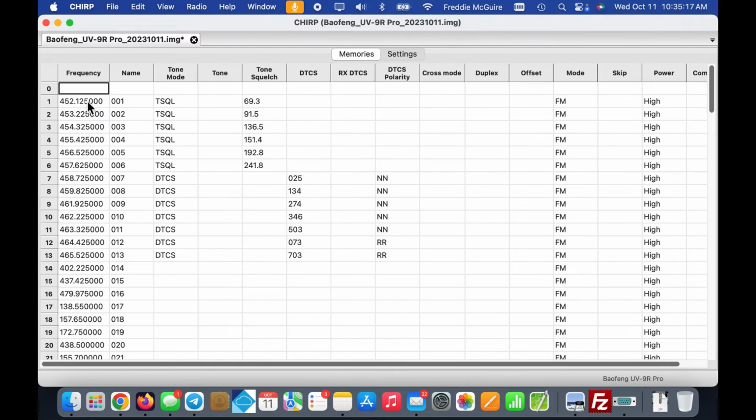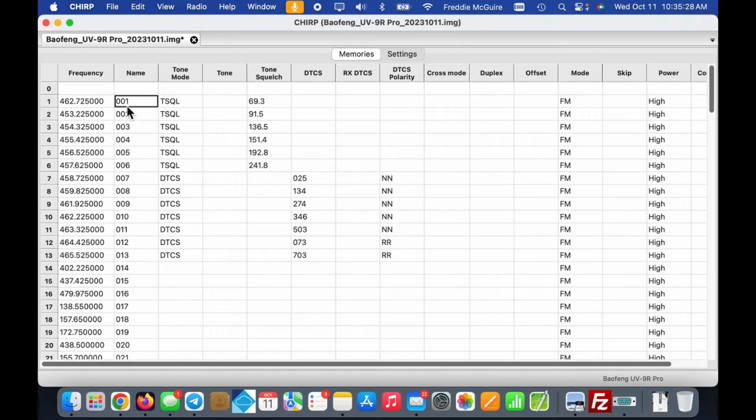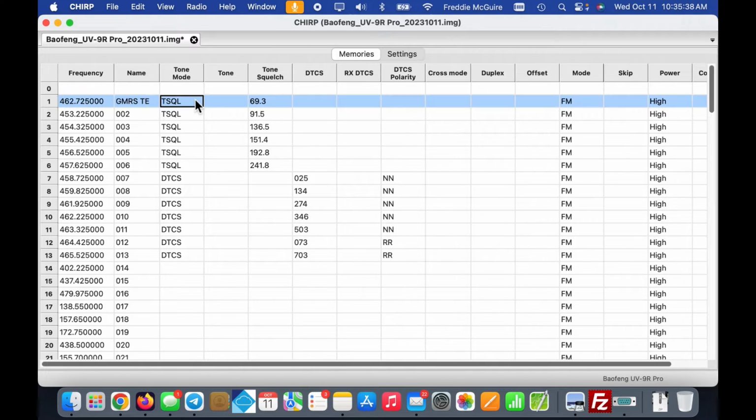Let's go back to memories. I'm not going to mess with channel 0. Let's go 462.725. And we will call it GMRS test. And we're going to turn off the tone squelch.